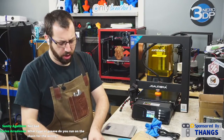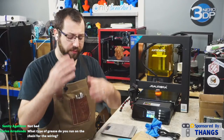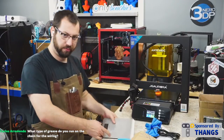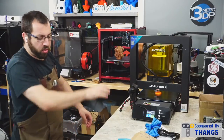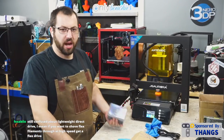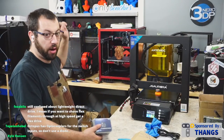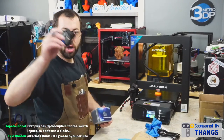Here's the thing with extruders though. Pretty much as soon as you go with a dual drive gear, like a Bondtech dual drive gear setup, you get diminishing returns. Going from these crappy stock extruders with a single flat drive gear and a bearing idler, once you upgrade from that to something like an Orbiter or a BMG, any other extruder upgrade is incremental. Like swapping, now I'm running an LGX, right? Originally I ran this guy, I ran the Clockwork.